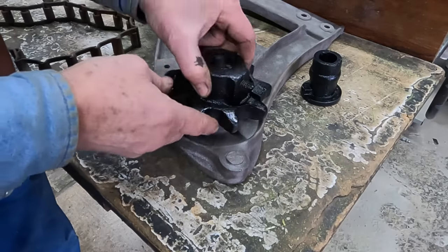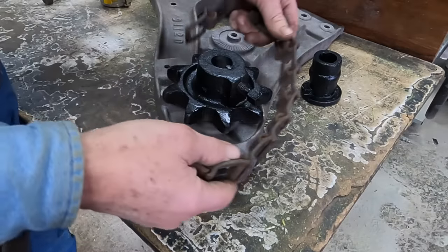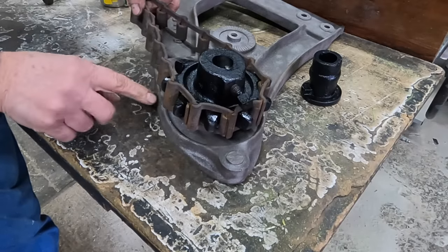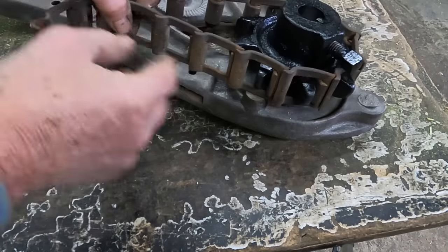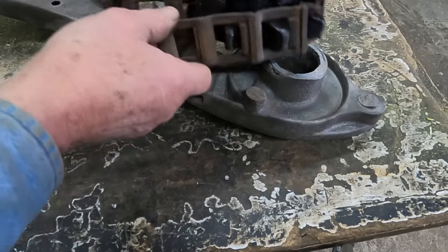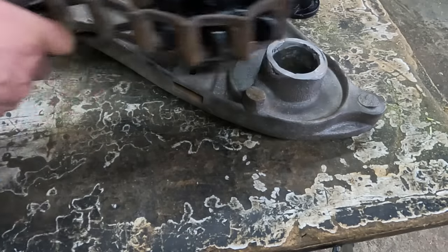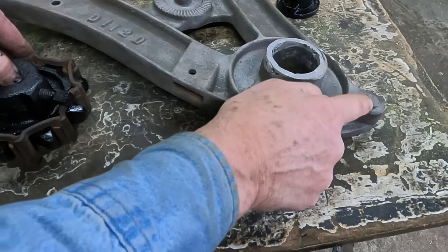Well, this is the gear that goes on this section. And I have some old chain here that's going to replace what was missing. And so this is going to go about like so. So it looks to me like this chain has been rubbing on this tab here. It looks like perhaps it has just worn this little groove through here, probably from the action of this chain. So I don't think I have to worry about replacing this, but I do want to replace this.